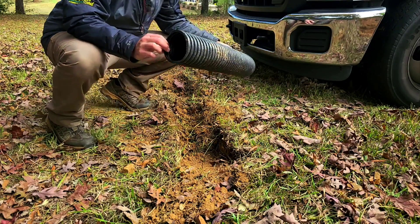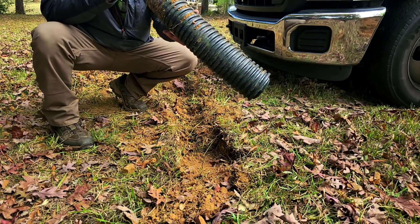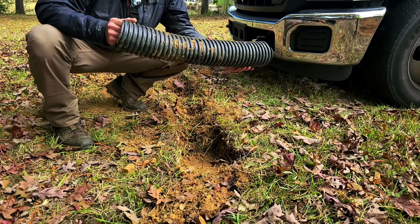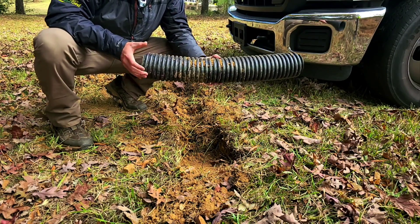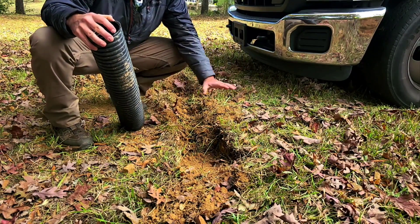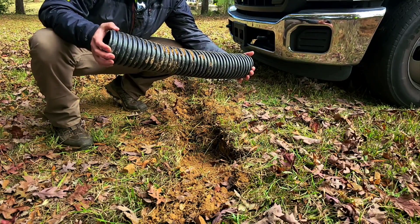It has actually taken a little bit of deformation — it's a little more pancaked here. Definitely worse than the double wall and worse than the PVC, but it's still together. This is a heavy truck with four passes over it; I'm sure over time this would continue to collapse, and that's not what you want. We're going to see how much of this is due to our trench — we have a nice wide trench, things could get underneath it and it is supported by the dirt, but that's with only about an inch to an inch and a half of dirt on top.